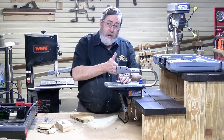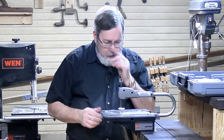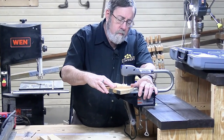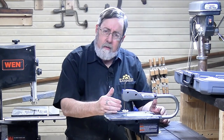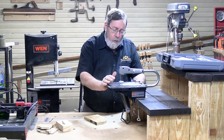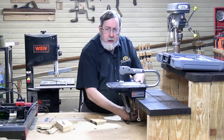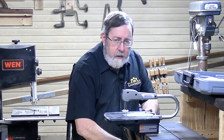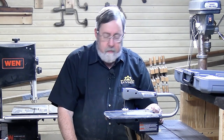I've installed the blade at the right angle, with the teeth facing me — though the instructions say it doesn't matter which way you face it. That cut really well. One thing I do notice is that you better have it clamped down well because you're actually pushing it away from you, trying to push it out of the clamps. That's just a matter of tightening the clamps properly — I actually don't have them real tight. That worked out well. We're able to cut at 90 degrees without any problem.